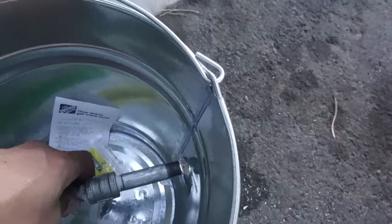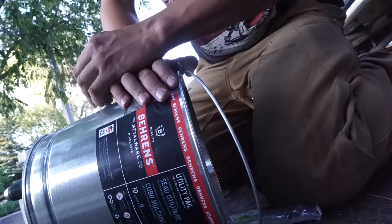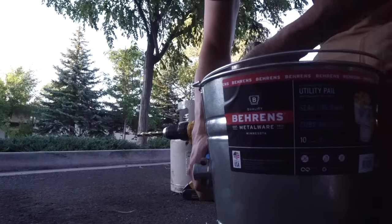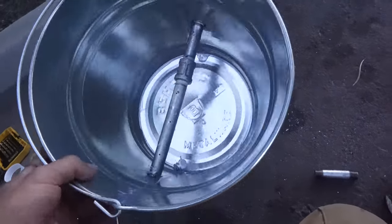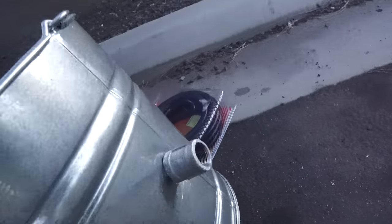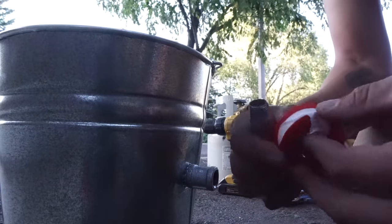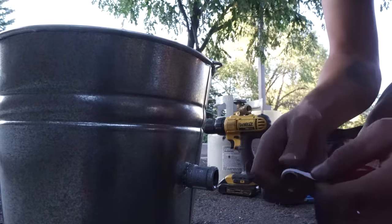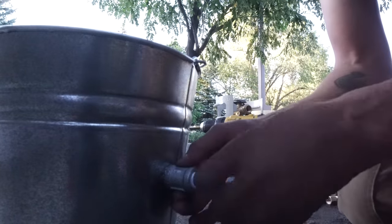You can see I've got my hole in the bucket. We're going to push the other end of this through here, then put the coupling on and tighten this up. There's the basics of it — end cap on this side, all your holes all the way across, and then a coupling on this side. Now we're going to take this nipple piece, put some Teflon tape on it, and thread it in here. This is just getting the rubber hose further away so it doesn't burn.